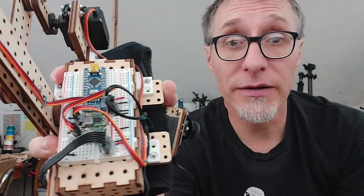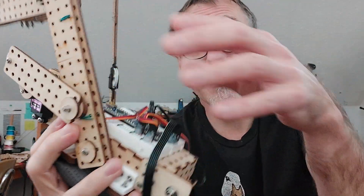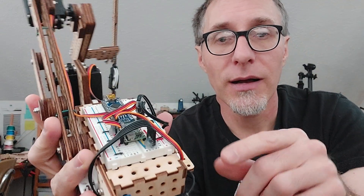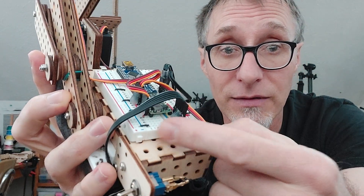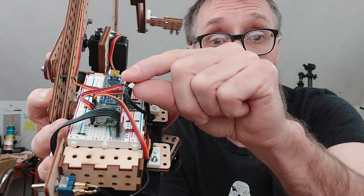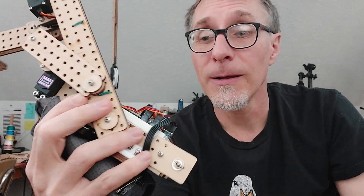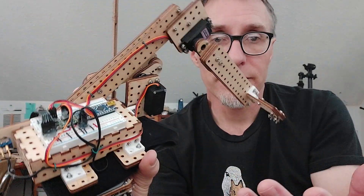It also has a circuit board. I'm using a breadboard here - beware, breadboards are trash, the stuff just tends to fall out, but they're fast. I'm also pretty sloppy, so use some hot glue. Put some hot glue on the board where the plug meets and give it a good solid hold. If you work it hard enough it's going to snap off anyway, but the nice thing about hot glue is you can peel it off and still change things. If you glue this stuff down so it doesn't move, you're not going to accidentally unplug something. It's kind of halfway towards a proto board and for me it's often just so much faster. By the time you start cutting wires to solder, I'd rather just design a custom PCB - and that's where I ended up. But you start here because it lets you work things out.